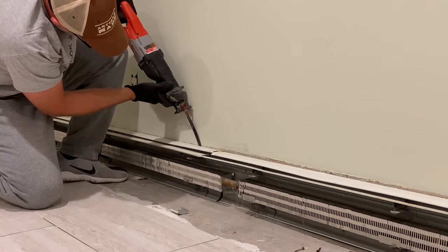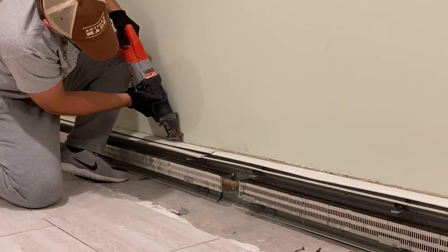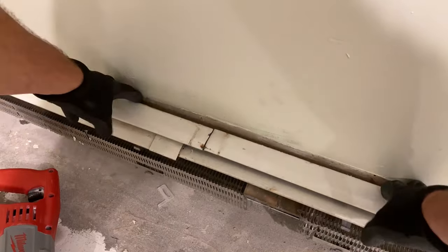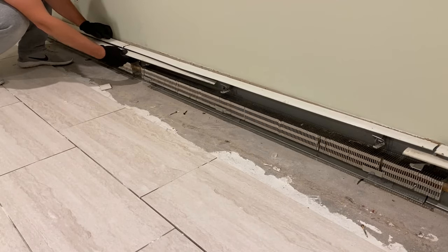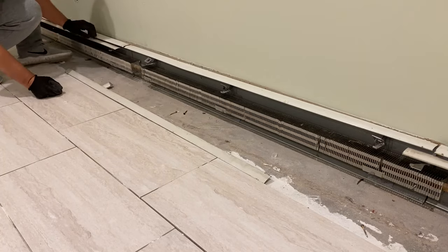If you're going to have to cut through some nails or screws, the process is pretty simple. You're going to slide the blade behind the back panel and just cut right through it. Be patient, don't press too hard — let the blade do the work.